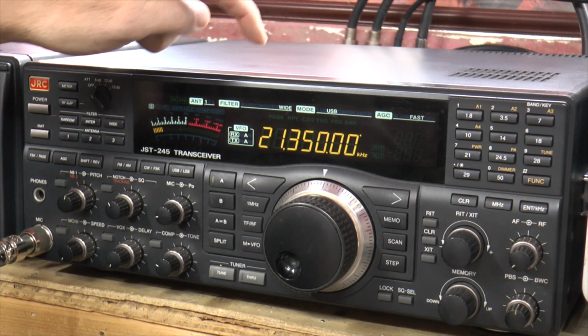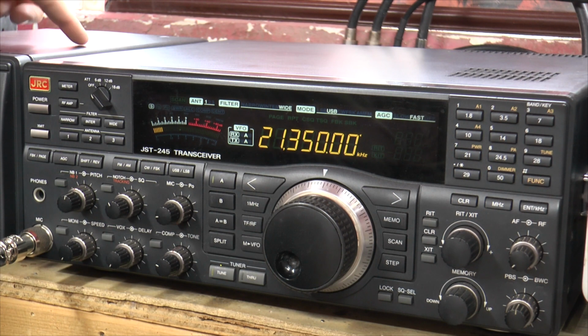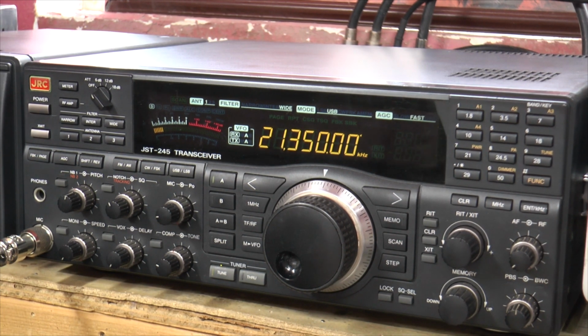There's a little scuff up on top here, and maybe a little scuff right here, but it's clean. It's a clean rig other than that, and for the most part, transmit receive wise, we're fine. Tuner wise, it's fine. I looked at it on the scope, it looks clean on transmit on all modes. So I haven't stuck a key on there, but I know they're decent CW rigs too. And like I said, I probably will slap some filters in here, just to have a CW filter, non-stock, and another sideband filter, so I get more selections. And that's the deal with it.